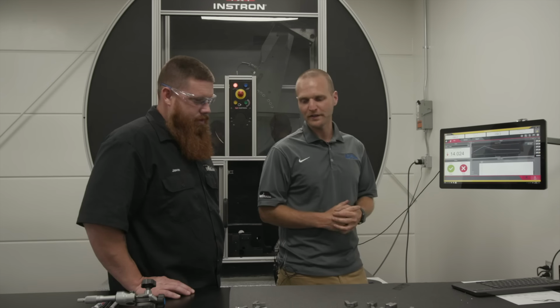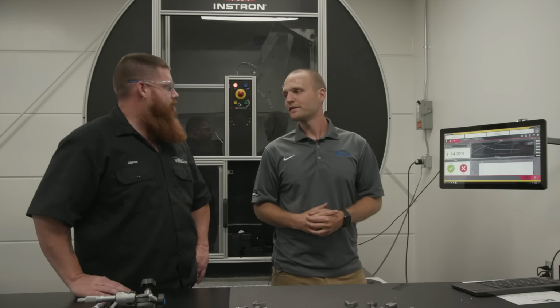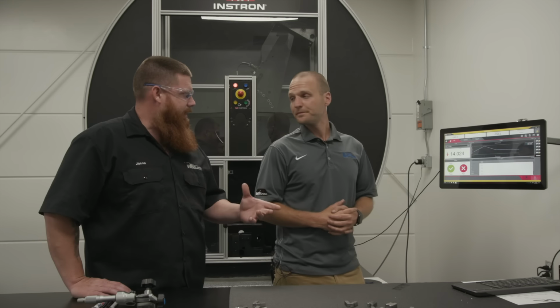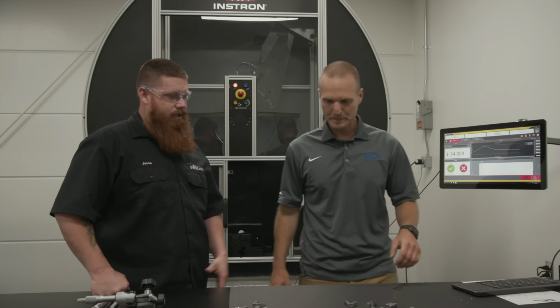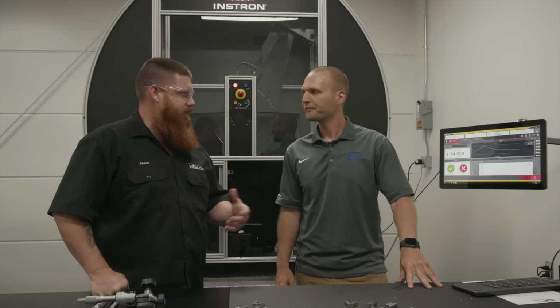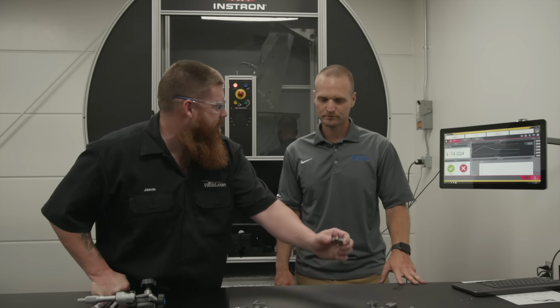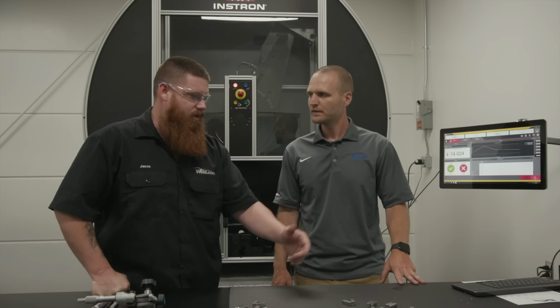So this is showing definitely that the higher heat input, the big wide weaves, really matters on your toughness values when you're doing the test. I know that the cap that we put on there was a bit excessive. I have seen people do that before. We just wanted to show the difference between stringers and weaves, but this wasn't pulled off the surface of the weld. This is actually a little bit inside of the meat in the center of the weld, and that's all weld metal sample.